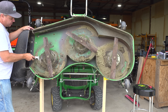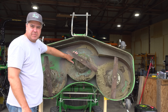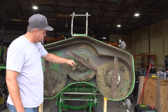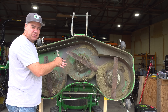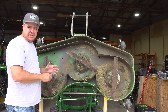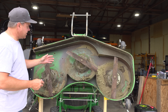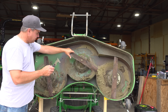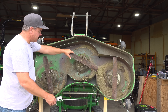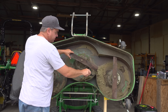Your deck will last longer if you can keep it clean under here. These decks are prone to rust because of this corrosive stuff that gets under there. If it rusts enough, the whole deck just loses integrity, and that commonly is why a deck just totally wears out. If you tear up something like a blade or even a spindle, you can replace it. But if the whole deck is just rusted through, there's not much left. So this is a good way to lengthen the service life of your deck.